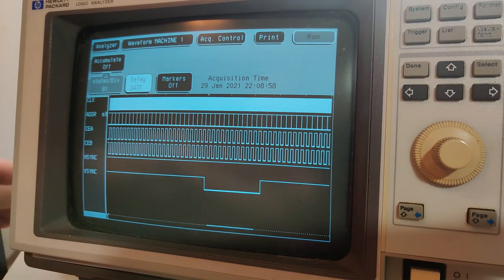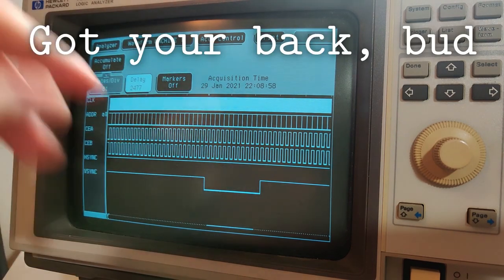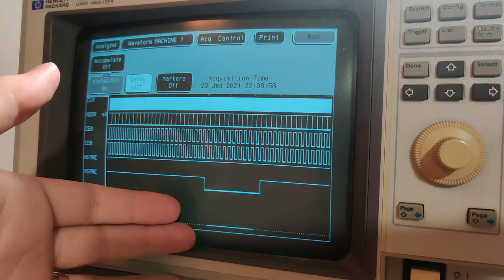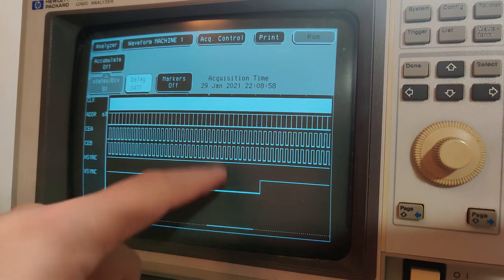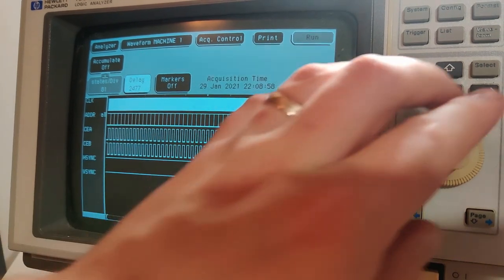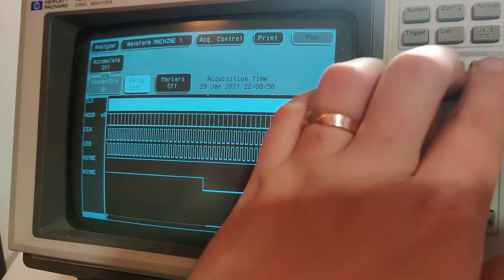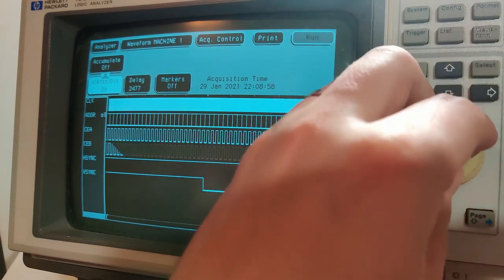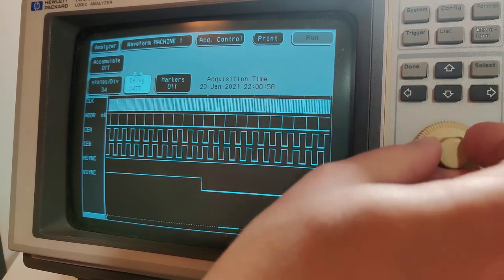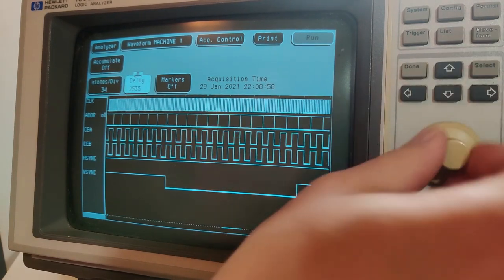Oh! I had a dingus moment! We just tied video to the 25 megahertz clock, didn't we? We just tied the address counter to that. I think we're always counting the address. I think that's what's up. Could not be, but that strikes me as the most obvious dingus thing I would do. And when it's me, expect the obvious dingus thing.